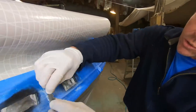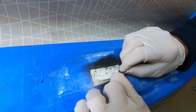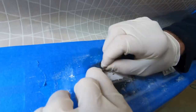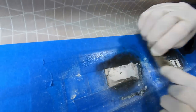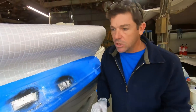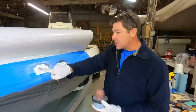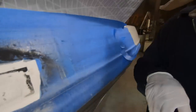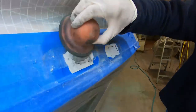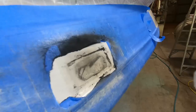If we jump over to this one that we already did a little scraping on, it's going to highlight it. You can see right there — if you remember last night that was the deepest point of the damage in this boat and that's why we overfill. Gel coat a lot of times will shrink or retract back a little bit. We have brought this down quite a bit. You can tell there's still a little bit of edge there, but generally that's going to be very flat. I'm not trying to get it perfect with the razor blade — we're going to come back with the guide coat.